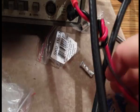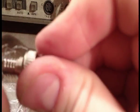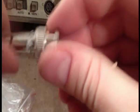Okay. That looks good. Now, the last piece. You slip this barrel on here. And then you push these wires up like this. And then you slide the ferrule on top. And if you really are truly concerned about shorts, this would be the time to test it before you crimp it, because there should be enough electrical continuity that you can actually test it. Because once you crimp it, it's on for good. It's not going to come off easily.